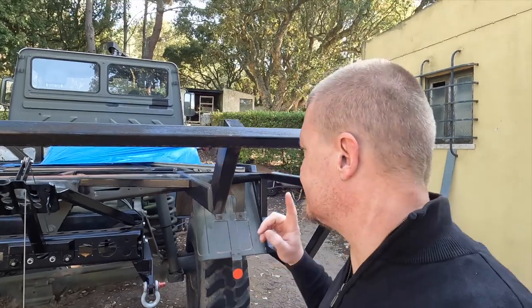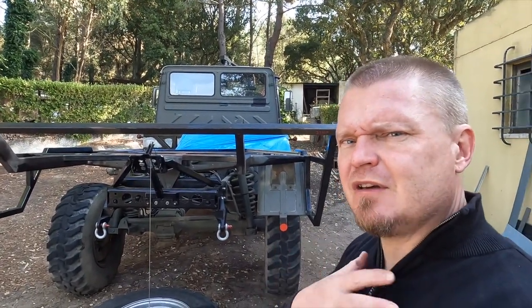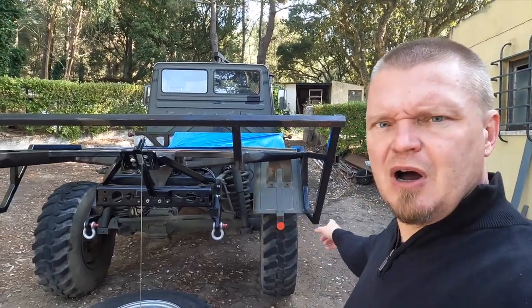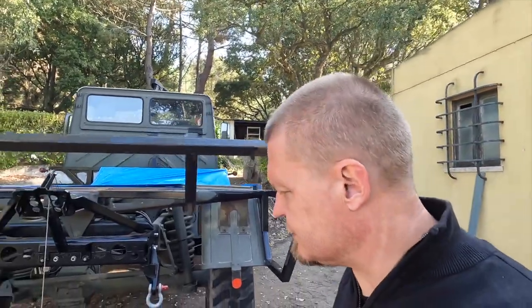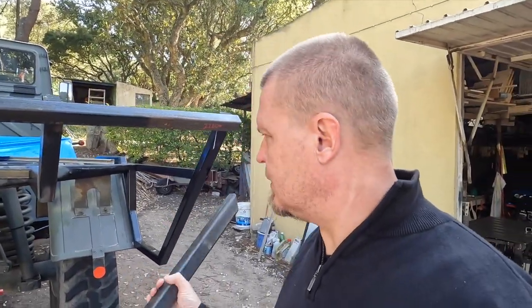With the reinforcements put in place, I thought I was done, but I was looking at this and thinking that maybe a little bit more wouldn't be too bad of an idea. This part at the back here is going to be covered with sheet metal, and we decided that we would use the 2.5 millimeter thick stuff there, so it's pretty hefty. But in my head I thought that if there's going to be a sticky up bit here that holds the roof and all that stuff, it would probably be a good idea to connect that thick beam with this thinner beam. So I made some sticks to go in here.